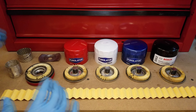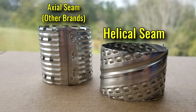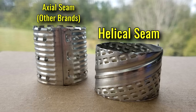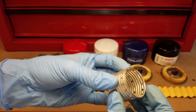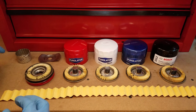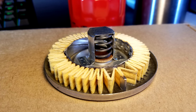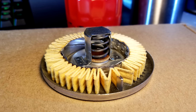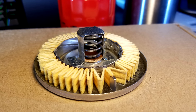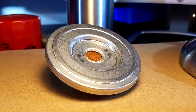The center tubes on these guys all use the same helical style seam — you can see it running up along the outside edge. That's generally considered stronger and more desirable than the single axial seam design you'll see in other filters. This one's from a Fram Ultra that I've cut up before, just for comparison. That's a plus for all these guys using the same thing.